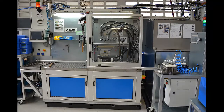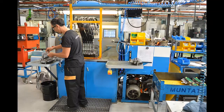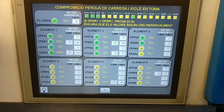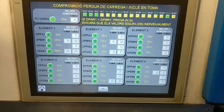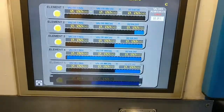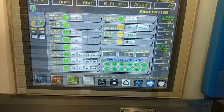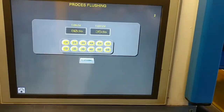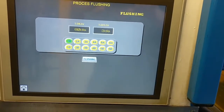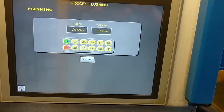When a valve is completed, it is placed in the fully automated test area for test while the operator continues with the next valve. The automated test cycle includes internal and external leakage, leakage of pressure check valves, setting of port reliefs and the main relief if there is one, function of anti-cavitation valves, pressure drops through each spool — which checks specifically if throttles are fitted where necessary — and finally a flushing operation.